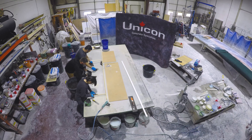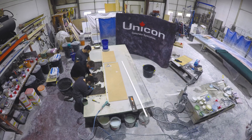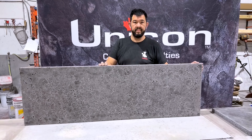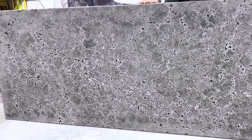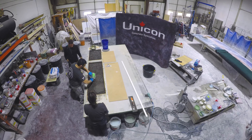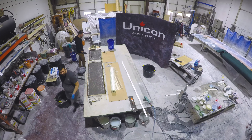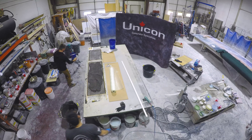Step four: it was really cool to mix the concrete together and push it into the mould. Simon had this amazing DIY texture technique. As you can see in the time lapse, there are three of us — his daughter, myself, and Simon — pushing in the mix. We left air pockets intentionally against the surface of his pour table. You push it in bit by bit, and there are going to be all these cracks and crevices that get filled with grout later. If you're doing this yourself, it's nice to do it in a changing pattern, be a little uneven, and if you have more than one person you'll get different patterns. Just keep switching where you're working. That's how you get a highly featured piece of concrete.